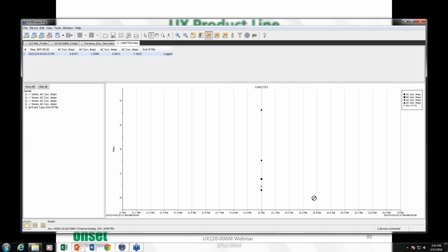Another good question on the LCD. If we're dealing with extremes in the low temperatures and the high temperatures, if the screen goes blank, is the logger dead? No, it's not. The actual electronics of this unit can go from -4 to 158 degrees Fahrenheit. That's basically the operational temperature range of alkaline batteries. So the logger can definitely handle that entire range. The logging side of it is still chugging right along in the background, even if the display has gotten sluggish or if it's gone black.